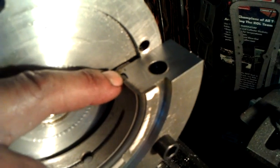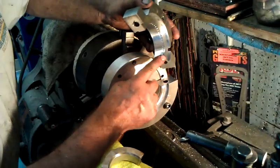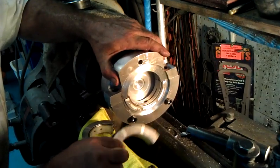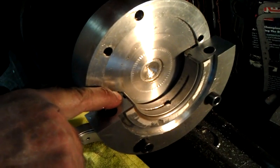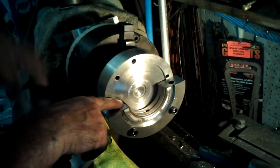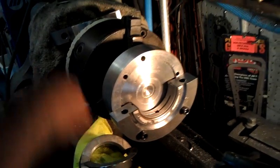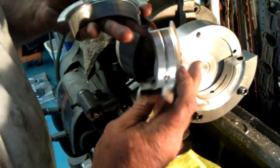These little tabs that we've cut out — the Dodge Viper has two tabs on one side of the engine, here and here. So when these mating surfaces go together, both tabs are the same. However, the truck motors are a little different. If you use the wide thrust surface, you have to go to your block and re-cut a different tab, because it's on the opposite side of the motor, and the truck bearings also have their tabs facing each other. So when this bearing goes in, you're dealing with a tab situation like this, versus the two tabs on the Dodge Viper bearing where they face each other and are opposite one another.